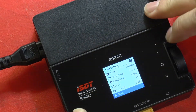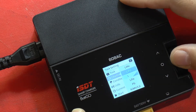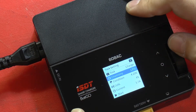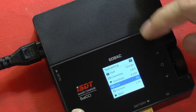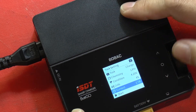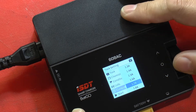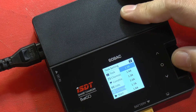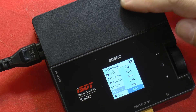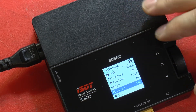Now we go into the menu. We're going to charge — the chemistry on this one is a LiPo, not lithium-ion, so we select LiPo. The condition is 4.2 volts; this has four cells and it detects that automatically. For the current, you don't want to use 1.7 amps — that's too much for this battery. This one was 850 milliamps, and you can either do 0.8 amps or 0.9 amps — 0.9 amps is fine.